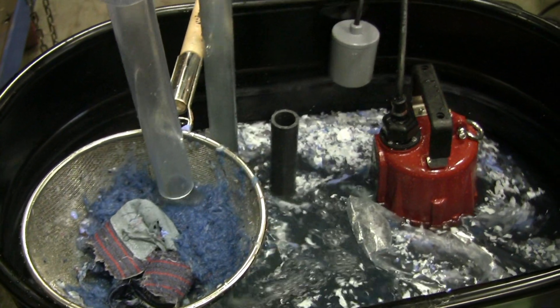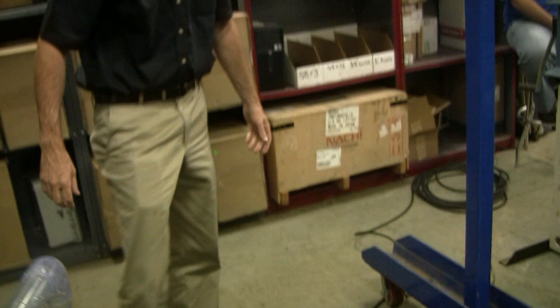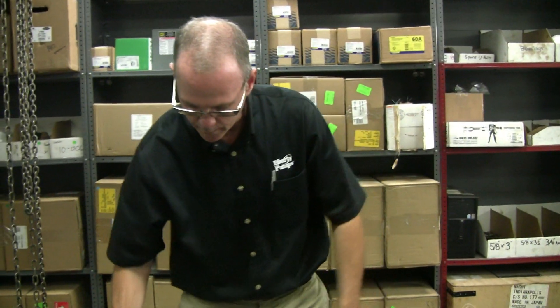I think that's enough for demonstration purposes. But let's say two years from now, the cutter dulls a little bit. The cutter is hardened stainless steel, but if it's chewing on abrasives or sand or something, it might dull out a little bit. If it gets dull, maybe it will jam on you one day.